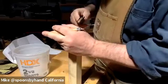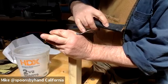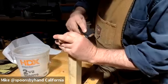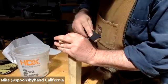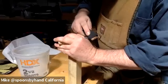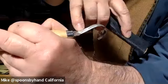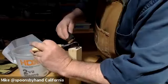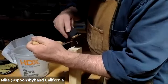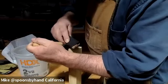So basically, I hold it in this weird position so that I can go this way out to the cutting edge. So for a regular right-handed knife, this seems awkward, but I found it the best way. I'm just trying to do this until I get all the scratches removed from the Dremel. And sometimes I get bored and I'll go along this way. That spot right down there is a real problem. It's very hard to get that spot. And this is the Yogi Sundquist trick, to just prop it up on something. So you can see the scratches from the Dremel melting away under the 180 grit.